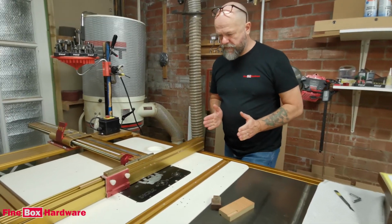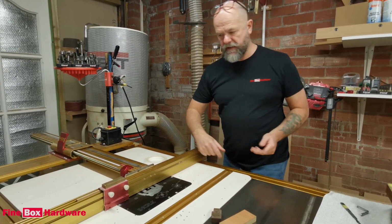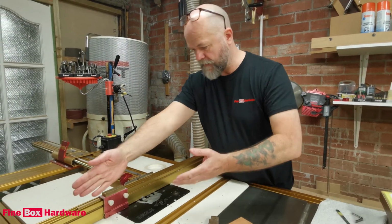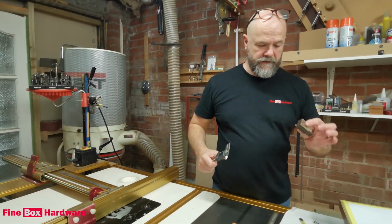We make these cuts first, which is actually going against the rotation, the proper way to route. And then when we do the other couple of mortises, we'll turn around and come in this way, which is with the rotation.